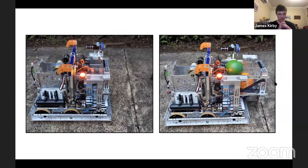And so for low down side hits, the bottom draw slides can tank that. But for all the vertical stuff for picking up the balls and running over something, those vertical draw slides can take it and save the bottom ones. And the bottom ones are upside down so that they're less likely to pop out with the vertical impact. This has worked really, really well. We carry the robot by that mechanism extended, which should be a testament to just how strong these draw slides can be when used correctly, because we're pretty much at the weight limit. And yeah, that's a great way of doing that.